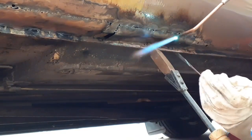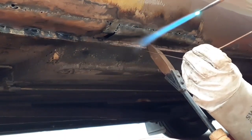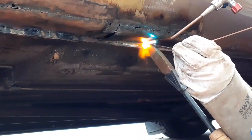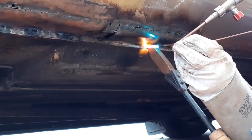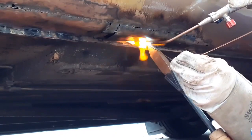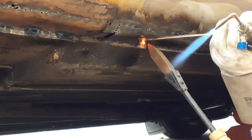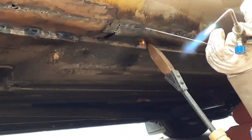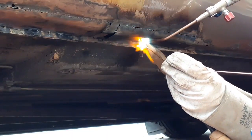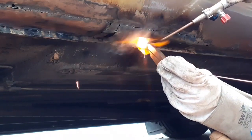I need to keep myself out of the way of the flame. I'm going to aim the flame at the flange, which is two sheets welded together, and try to avoid direct contact with the flame on the thinner material. It's very awkward because I can't really get my head in there for obvious reasons. I don't want my body directly underneath the job in case of any molten splash - it would go straight onto me.